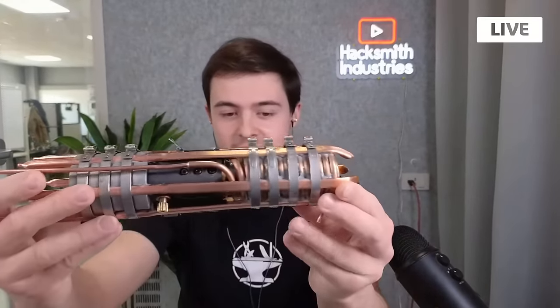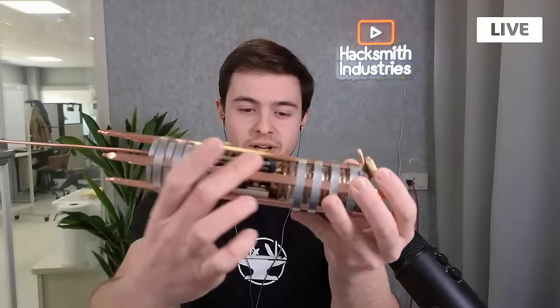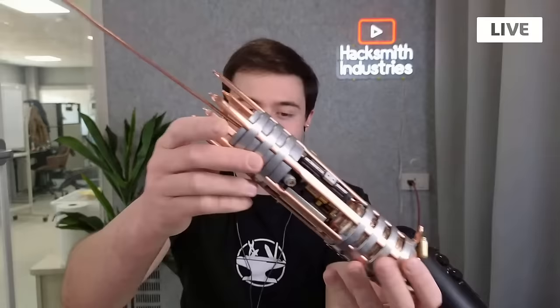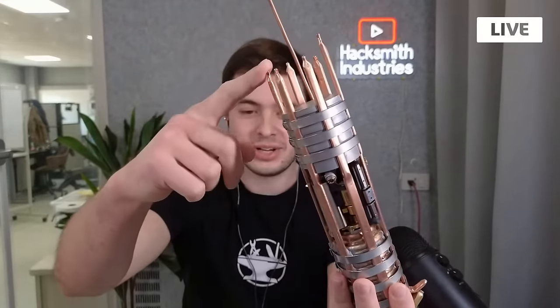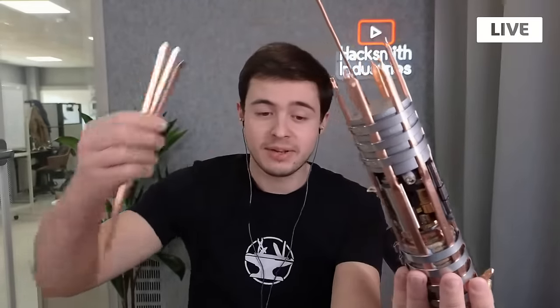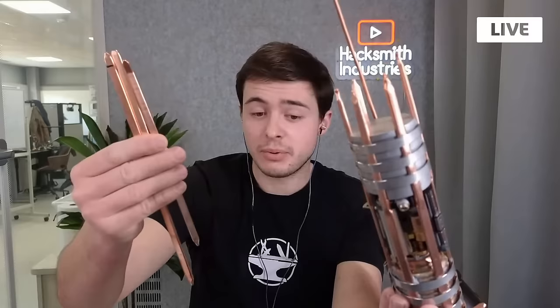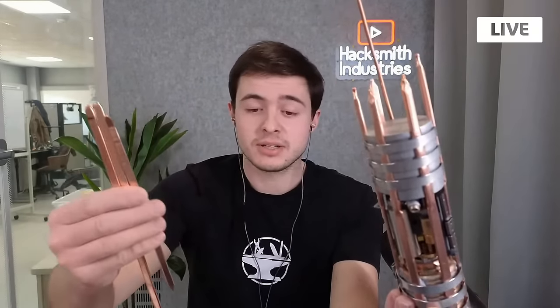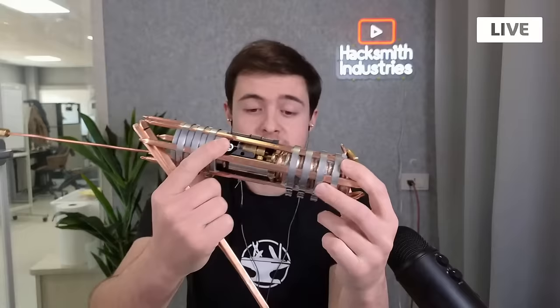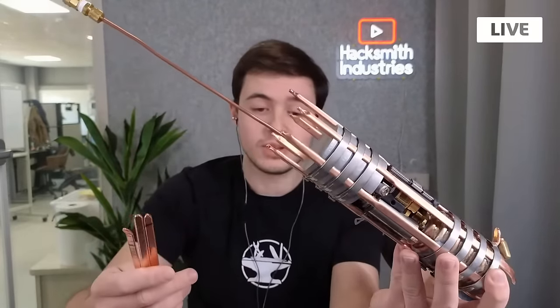This is the real thing as it was modeled and as it was 3D printed, with the whole vaporizer on the front and the fluidics in the middle. You can see there's a little rail there to turn it on and off, and there are heat pipes — the ones I'm using for this are a little long, so in SolidWorks I'll show how to change that really easily. I've been playing around with different sizes, and it's important to me to be able to throw in a different size, see how it's going to fit, figure out what kind of clamps I need, and then make the real thing and test it as quickly as possible.